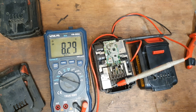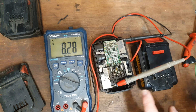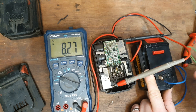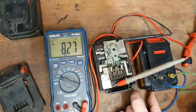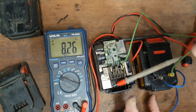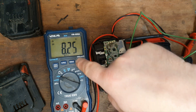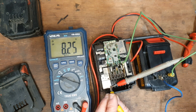What we're going to do now is connect this full battery — this full knock-off DeWalt battery — to the M18. What that'll do is bring the cells up to a chargeable voltage, hopefully, and give us a battery we can charge. I'm monitoring the voltage of the battery as we go so we can keep an eye on what's going on. It's at 8.25 volts now — let's go, there should be a bit of a spark here.